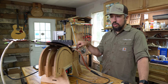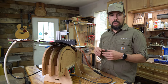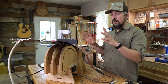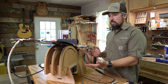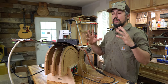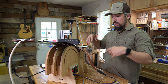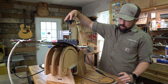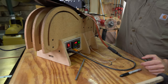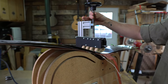The real advantage of the side bender versus doing it by hand — and there are hundreds of videos about doing that on YouTube — is that once it's done bending, I turn the machine off and it stays inside the mold while it cools off and gets back to room temperature. I think it allows the wood to relax in its final shape, and when I pull it out of the mold we end up with a very stable piece. We're just crossing boiling point, so now I'm going to start applying just a little bit of pressure.